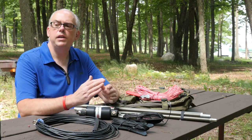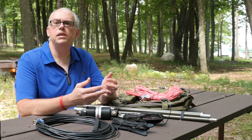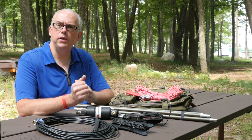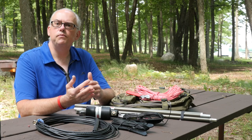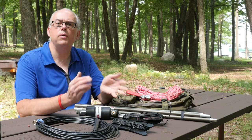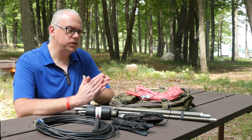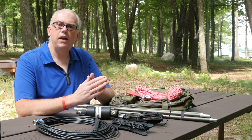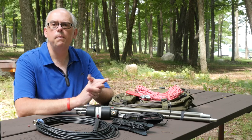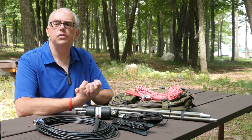And then finally, you're also going to need a wide-ranging antenna tuner to use this antenna. Now, in most circumstances, the SWR between the 80-meter and the 10-meter band is going to be under 3-to-1. So if you've got a built-in tuner in your rig, it should work. That auto-tuner should work quite well with this antenna system. Otherwise, an external tuner is really required. Although I have found that this antenna is resonant on the 20-meter band, so you get a very good resonance there. But on the lower bands, a tuner is almost necessary.